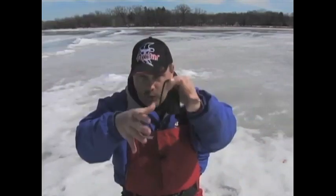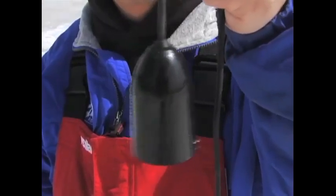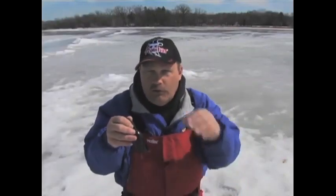The 12 degree is the best all-around transducer that Vexilar offers, and it comes with a lot of the systems that have zoom zone capabilities. The 19, then you have the 12. This is the 12. Well, the 12 gives you a narrower beam and increases the performance of the zoom zone features to give you tighter resolution to the bottom. So we often say when you're fishing in 45 foot of water or less, the 12 degree is a great choice.